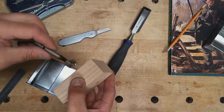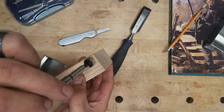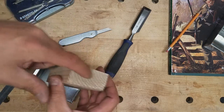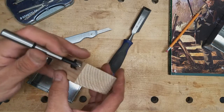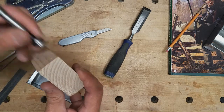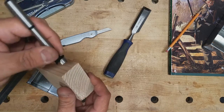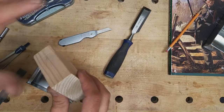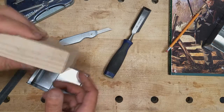If you just want to be on the safe side and double check, take your Forstner bit, give it a little spin, make sure you've got clearance — depending on your tin it could be really tight, but hang in there. Now, when I drill near the end grain, this is going to be your highest risk for blowout. The end grain isn't very strong, especially on softwoods. So just take it slow, do little bites at a time, don't put a ton of force — let the drill bit do the work and you'll get a pretty decent result. And even if you do have blowout, as long as you go slow and steady, it's not going to impact the block's ability to hold your rounds in the tin.